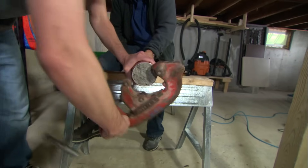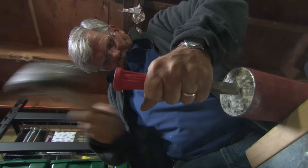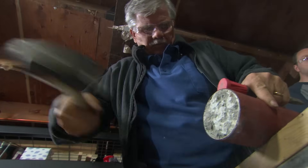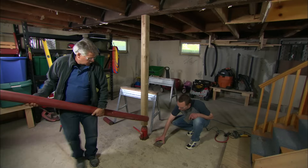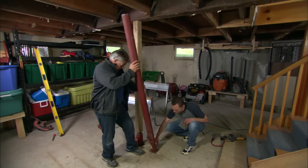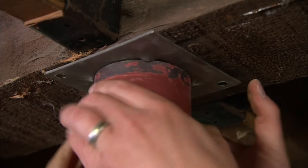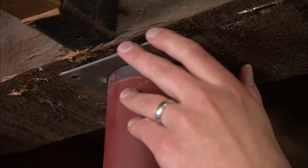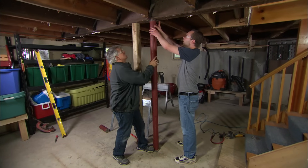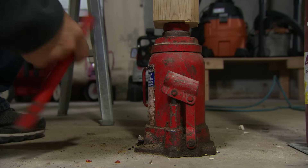Give it a little another turn. There we go. It looks pretty good — I just have to knock off those high spots with a cold chisel. There's a good footing in the location where the old post was. Now all we have to do is put a new plate down on top of the old post location and put the post in place. Center it right on the top of the column — little divots right there allow that. Now I want to center it on the beam. Keep your fingers out of the way.